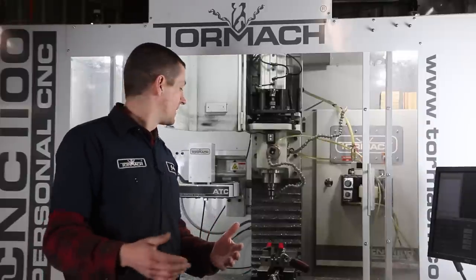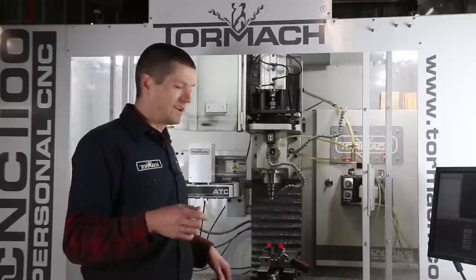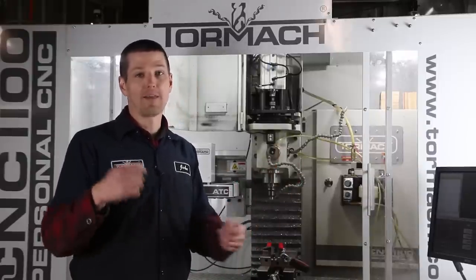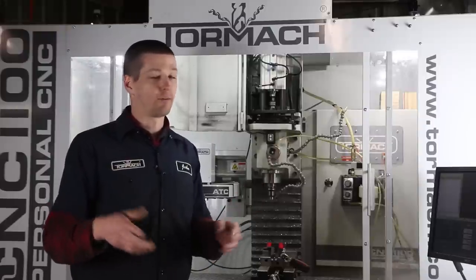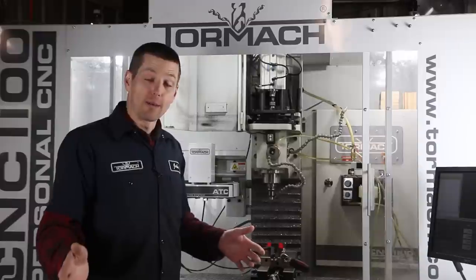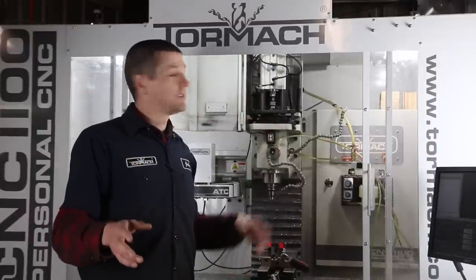The truth is I really haven't had problems. You want to keep an eye on the oiler - I try to check the ways and make sure the oiler is working. I should probably go through and check it, make sure the ferrules aren't leaking, but I just haven't had any problems. Then this started leaking, and I fixed it by tearing the thing apart and swapping out two of the seals.